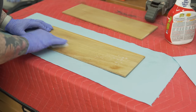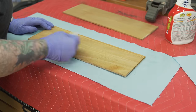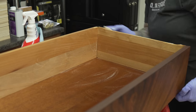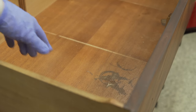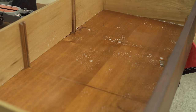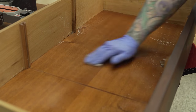I'm super happy with this piece because normally I have to completely refinish the inside of drawers — these drawers aren't in terrible shape at all, they just need to be cleaned, which is pretty typical. The top drawer did have a little bit of damage with some stains on the bottom. I could have painstakingly removed the glue blocks and sanded it down, but there's no guarantee I'd get those stains out anyway, so I'm going to clean it really well and put a felt liner in the top drawer.